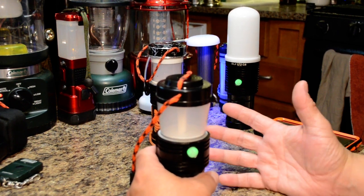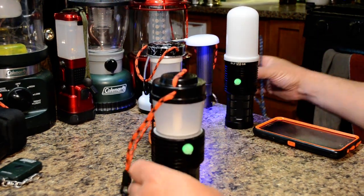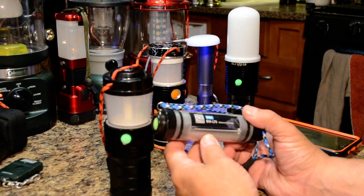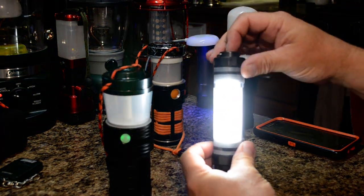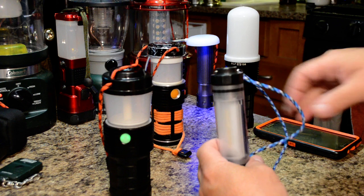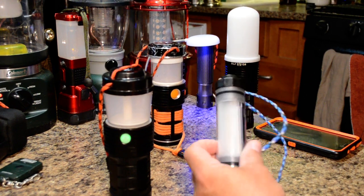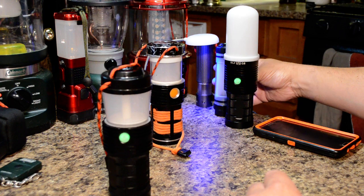It smooths the light, so it's a good balance: slightly frosted so you can still see through a little. The best aftermarket diffuser I found with that roughly 40 to 45% frosting was the BlitzWolf BW-LT5. Like my other lanterns, this one is also modified — it has high-CRI 4000K LEDs because I didn't like the cool white that came stock. Cool white isn't practical for a lantern; for a campsite you want something warmer, higher CRI, and more pleasing to the eyes when illuminating a larger area.